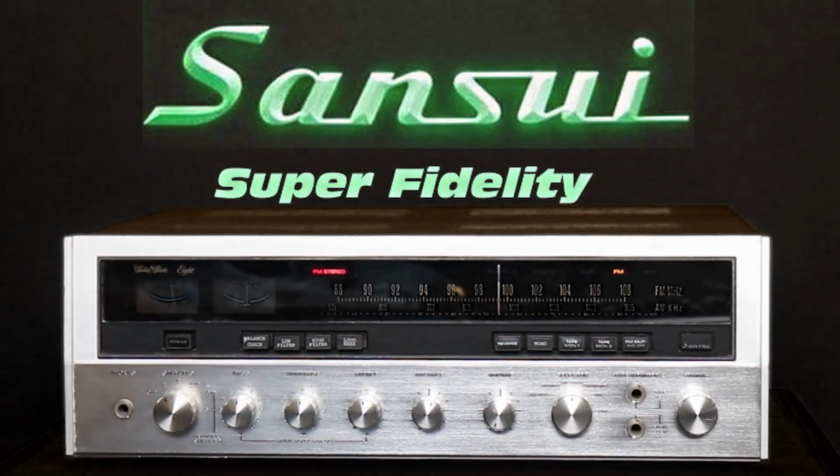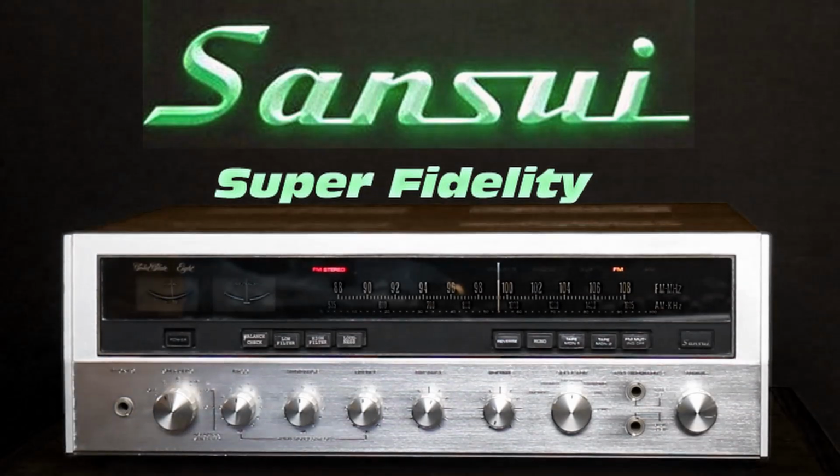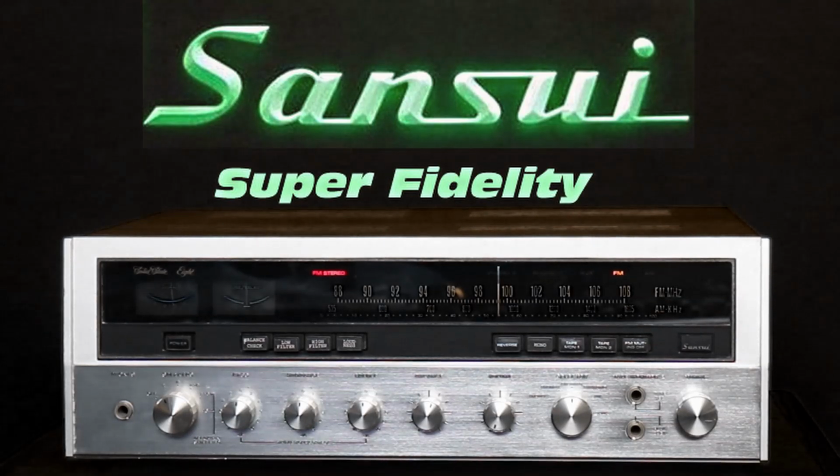I'd like to just give you a little background on the Sansui 8. Production started in 1970, so about 50 years ago. It's rated at 60 watts a channel into 8 ohms, 80 watts per channel into 4 ohms at 0.3% distortion. You're able to hook up 3 pairs of speakers to the unit, but only 2 pairs maximum can operate at any one time. It has AM/FM stereo. It does have 2 phono inputs, an auxiliary input, and it has 2 tape monitors.